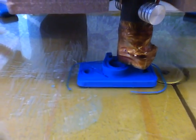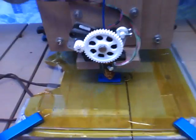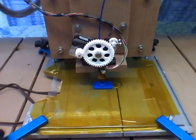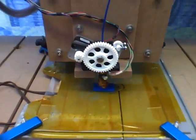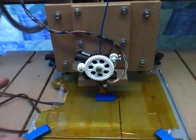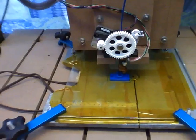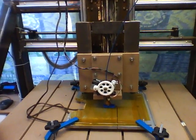This is the first thing — a 10mm rod holder. We're going to see if this works out. If it doesn't, I'll use half-inch aluminum and mill these brackets, because they're about $7 a piece, and that's a lot when I need a bunch of them. The CNC machine as a giant RepRap is working incredibly well. Now that I have all the RepRap stuff figured out, when I build the dedicated fast machine it should be a piece of cake to transfer this over — basically just change the steps on the motors and acceleration curves and hit go.